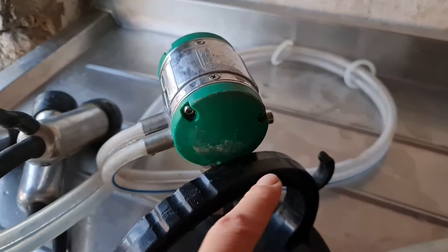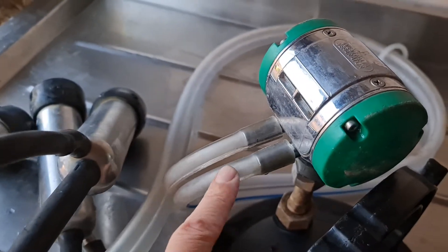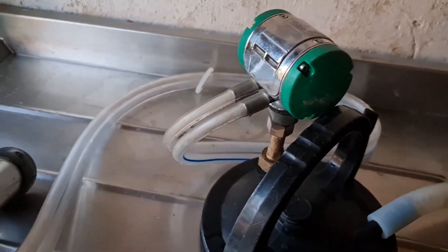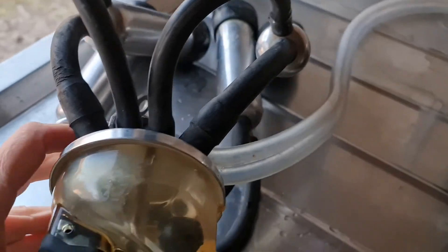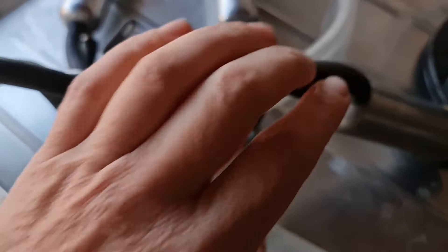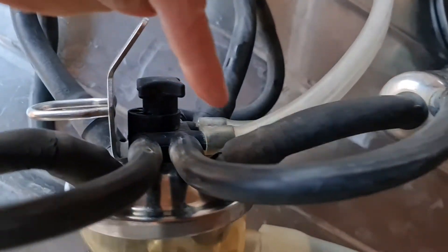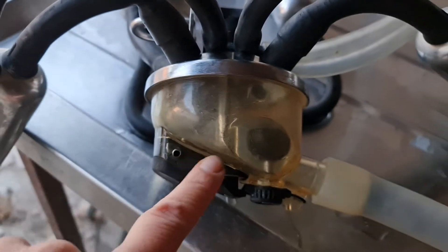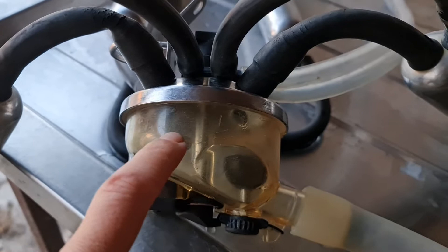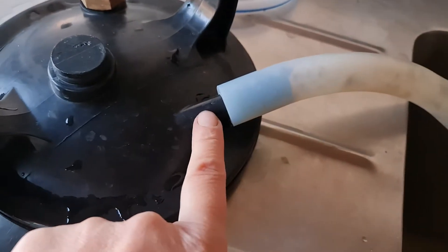When this sucks, the airline — which now goes through pulsating from the pulsator sat on top of the bucket — through to the cluster. On the cluster you have an airline and you have a milk line which goes through and pushes the milk through those holes into the bottom glass of the cluster, and then this goes along the milk line into the bucket lid.